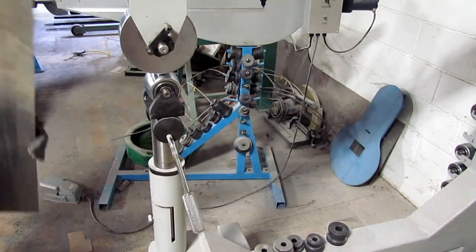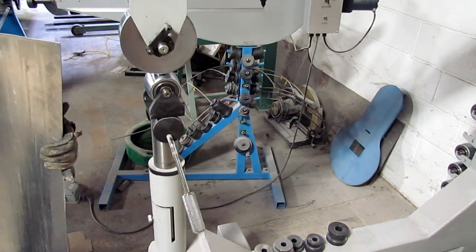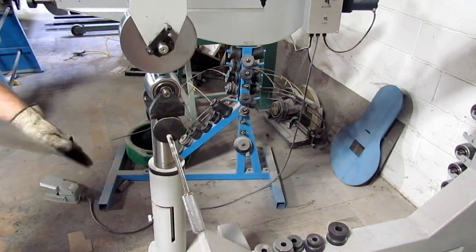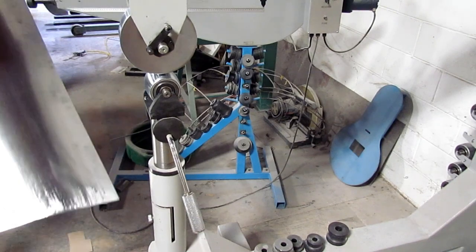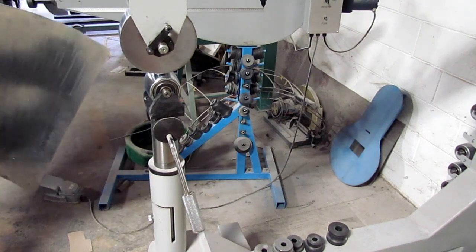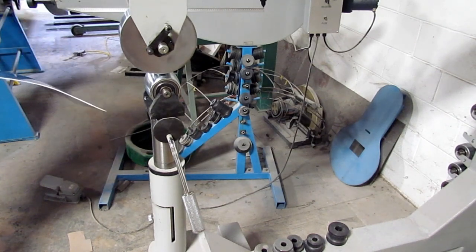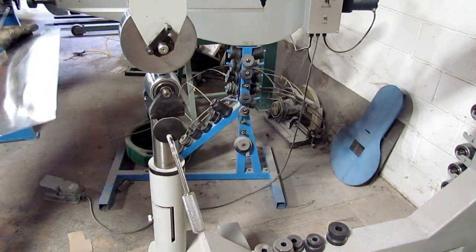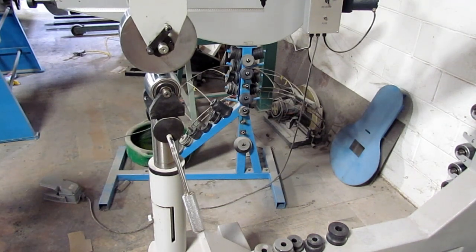It's got quite a bit of shape in it now. I'm going to switch over to the other wheel — the smaller one with a four-inch lower anvil. You can see it's getting that shape, and it's starting to get that return naturally there. We do need that to come up alongside the hood. Let's keep wheeling — we'll go over and test fit this, and work off the other, cheaper wheel for now.